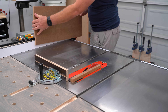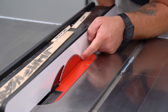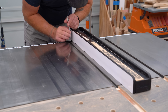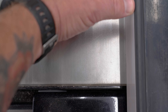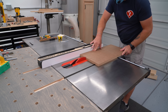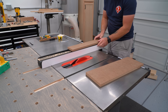One of these pieces will be the face, and the other piece is what I will cut the saddle material out of. To get the width of my fence, I locked my fence into position right where it comes in contact with the blade, and then I made a mark on the table on the other side of the fence to reference its overall width. Then I repositioned the fence to that mark and made my cut for the top piece. Of course, you could measure the fence and then set the distance to that measurement, but this made sense to me and it worked just fine.